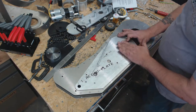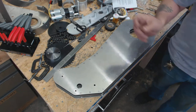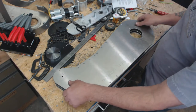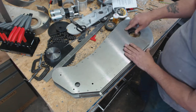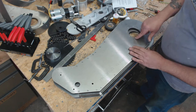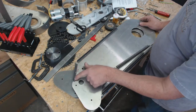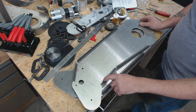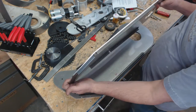So, how do we go about getting all these holes in here? Well, I already had to make another plate. I have to put the holes in here also. When Kyle did this, he just spot-faced the drill points, and that was what I wanted him to do because I have these pieces of steel angle in here that I needed to precisely locate. I said just put the locations in there and then I can do it by hand. And that's what I did, and it turned out absolutely perfect.